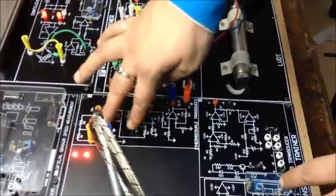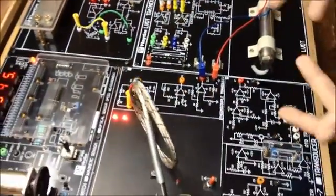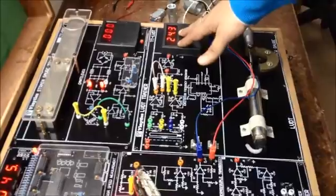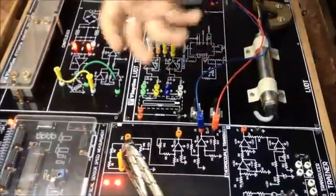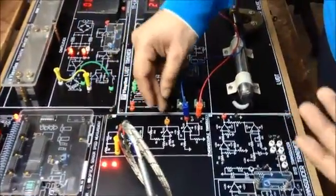Here, which you can see on the above, is the schematic diagram of our amplification circuit, and in the meter you can see 24.5. That is the basic temperature in degrees Celsius, that is the current temperature. You can also see the readings and intermediate stages at the different stages of amplification at TP1 and TP2.